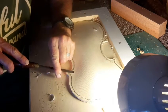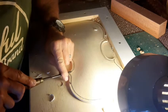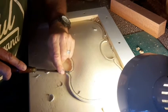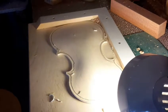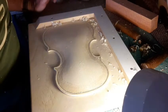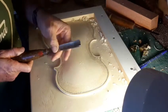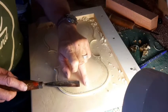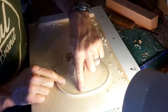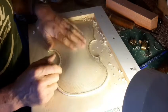I'm always stealing things from my wife — I stole a knife out of the kitchen when she wasn't in there. I'll show you what I did later. I've made my way around a couple of laps around the racetrack. I started with the small gouge, then used this larger one, three-quarters of an inch, and worked my way around not touching the tighter radius on the outside edge. I used my little planes to start to fare it all in, and I'm happy with how it looks — fared in, a little scratchy and gouged up.